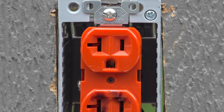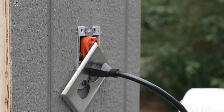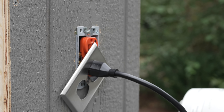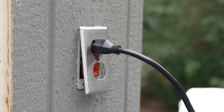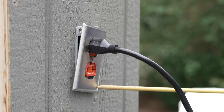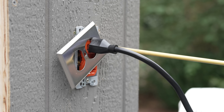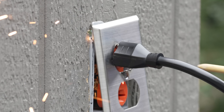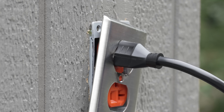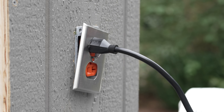The outlet and plate do get a bit of char in them. But now we'll flip that outlet upside down with the ground facing upward and repeat our test. Once the plate falls, it gets hooked onto that top-facing ground prong and you can see that it immediately begins a sort of balancing act. You might think this is a safer situation, except there is a real problem — that circuit breaker was never tripped because it didn't create a short circuit. Instead, what we've got here is a ticking time bomb. That outlet is completely energized. If someone reaching behind a piece of furniture was to touch it and eventually connected the plate to either the hot or the neutral, they would then create a short circuit within the outlet. Or even worse, once you're touching that plate with your hand, you could be part of the circuit, getting electrocuted or even killed.